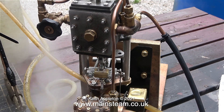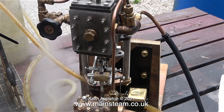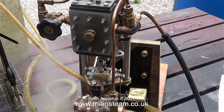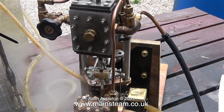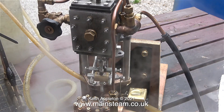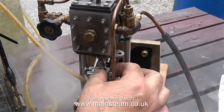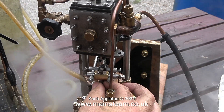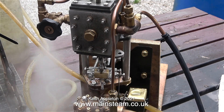The pump's mechanism seems to work okay but it's outputting far too much exhaust steam — it's blowing past something inside. The pump is working alright though; it's pumping the water out of the bottle through the piping and back to the bottle. With this type of pump I've found it to be a good idea to make the final adjustments to the valve once you have it in an installation.